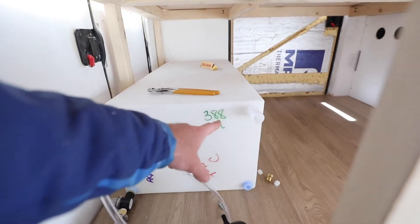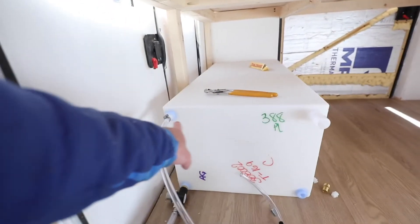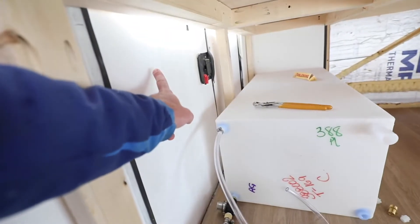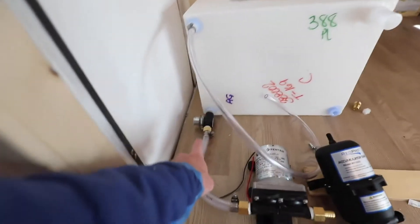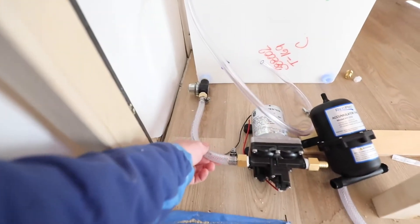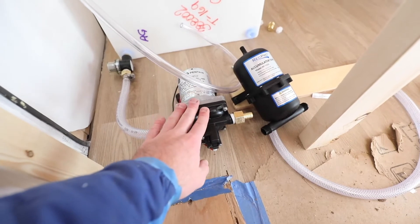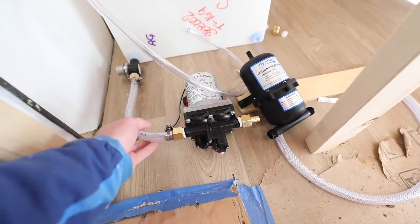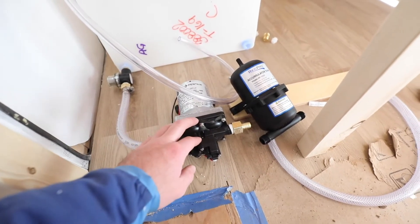As you're filling the tank you need somewhere for air to escape to relieve pressure from the tank, because you don't want to pressurize your tank. That's this line right here — air is going to come out here and go back out this port to relieve pressure. From inside the tank it's going to come through these fittings, through this flexible hose, through a strainer, through a flexible hose to the pump. They recommend with these pumps that you use flexible hose on the ins and outs because as this vibrates you don't want to pass that vibration down your whole system.